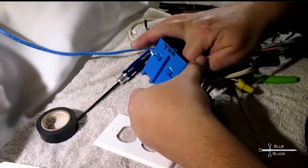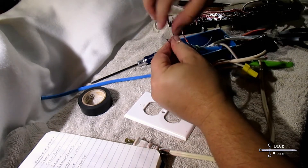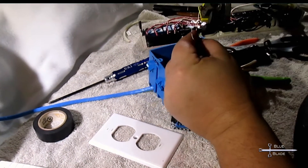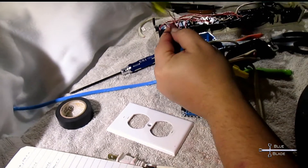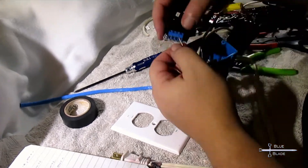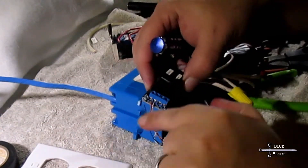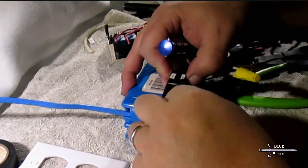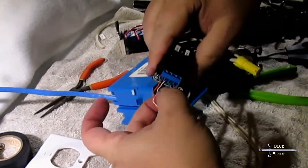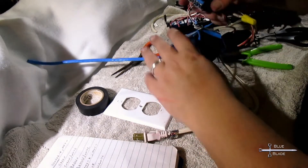Then I feed the wire out of the back of the box, free up the four wires, and strip about a quarter inch of insulation off of each. Now I connect the orange wire, which is DC 5 volts, to the screw terminal marked VCC. Next to that, I connect the orange and white wire for ground. Then the blue wire, which will be pin 34 on the Arduino, connects to the terminal for SSR relay number one. And finally the blue and white wire, pin 35, to relay number two.